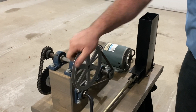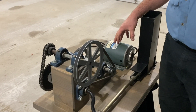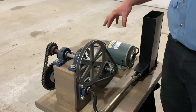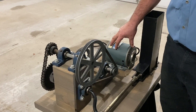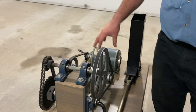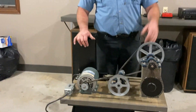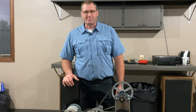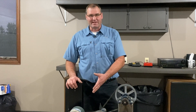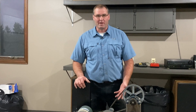As we look at how this was all engineered, we had a couple of challenges along the way. The first challenge is that we weren't sure how big of a motor we needed. I wasn't sure how to calculate how all of that was supposed to work, so I thought half horse — let's see how that works — and it turned out that's plenty of power. The biggest challenge was trying to gear this thing down. The motor is 1750 RPMs and obviously I can't crush 1750 cans in one minute, so I had to get geared way down.